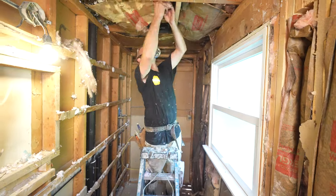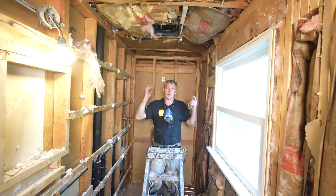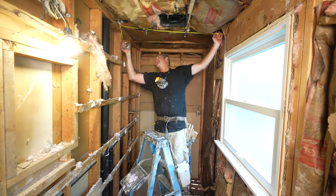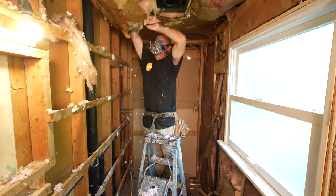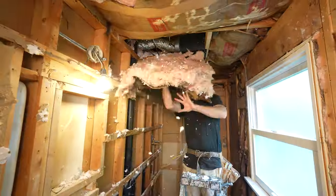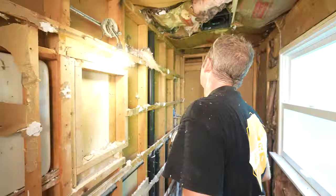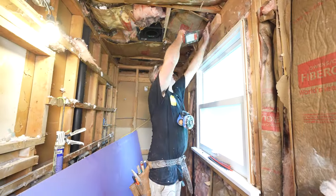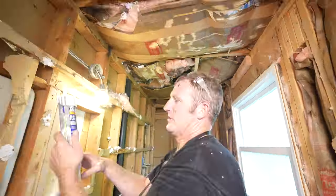At the end of the day, I like to go ahead and put my drywall into place. I find this really keeps peace of mind for the client — they don't have to look up into their attic space and they're not afraid of mice or snakes. I also like to run a wire for a separate light above the shower. Lighting is an important aspect in a small bathroom because any dim area is just going to make it feel smaller, so putting a recessed light fixture above the shower is going to make a big difference.